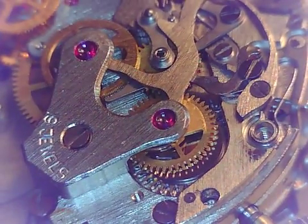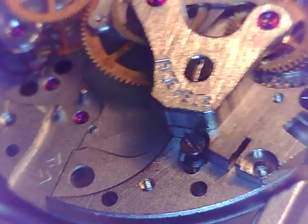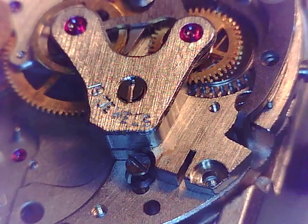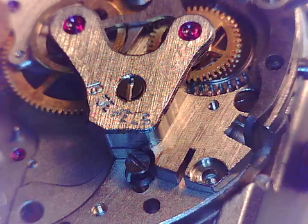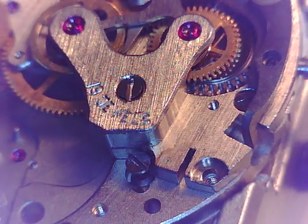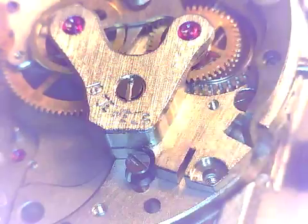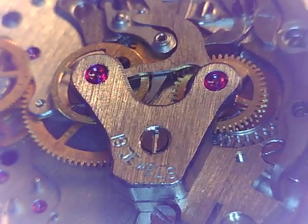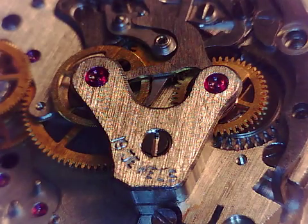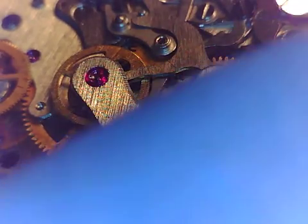its screw, and it's this guy right here. So that's going to capture all that, and it'll keep that in place. All that spring mechanism. I do want to put a little 8200 on that. Since that is a pivot point, put a little 8200 in there. And this screw is fairly large because it helps hold that chrono bridge in place. It ties that chrono bridge down.